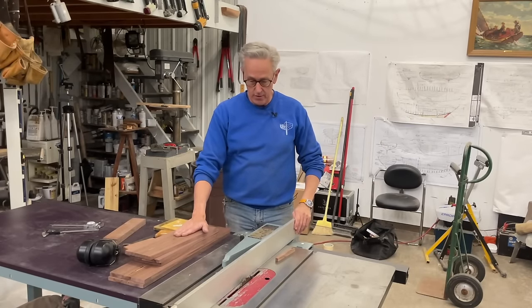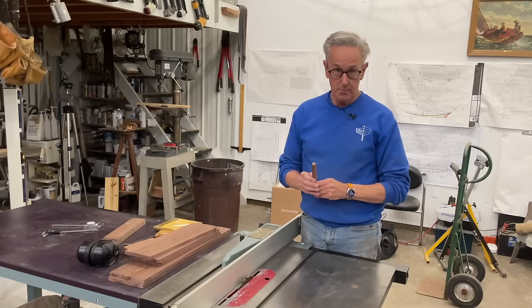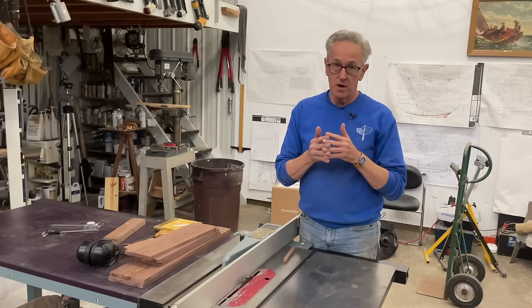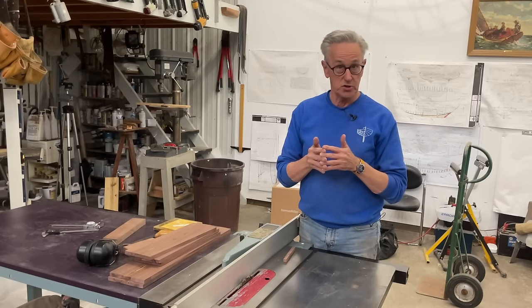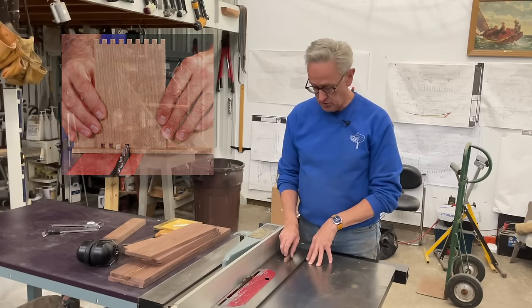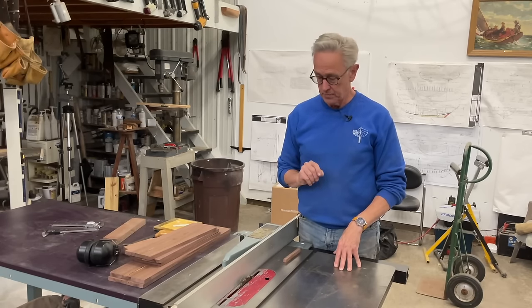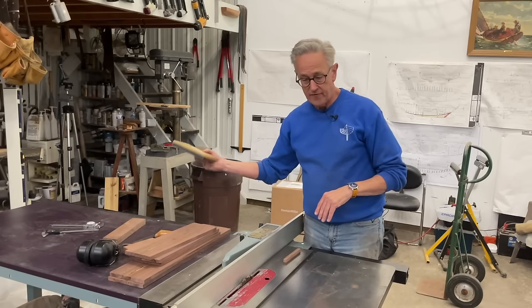I've got all of my half-inch material milled out now, and I also cut a little half-inch by half-inch piece that I'm going to use as a registration pin. The way I'm going to do this is the same way that a box joint is made. If you're not familiar with a box joint, it's where you make a joint where these tines fit together. You can Google box joint and find quite a few videos on how they're made. Essentially it's a matter of using a table saw blade, taking a board, and moving it notch by notch using a registration pin. Instead of just the width of the blade, I'm going to put a dado blade in here so that I'll cut a half-inch swath out at a time. You could do this with a router, but I think a dado blade is more accurate. So I have here a dado blade.